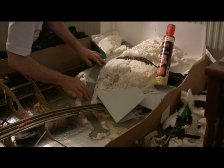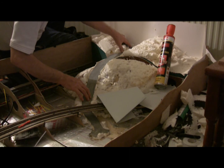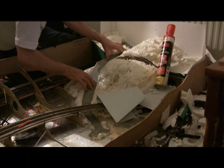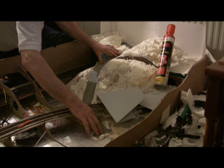and you have got to then stay with it, because obviously the foam is continuing to expand for the next 15 minutes or so. So it's a steady process of just pressing it down, adjusting it, and apart from the time factor, it works very, very well.